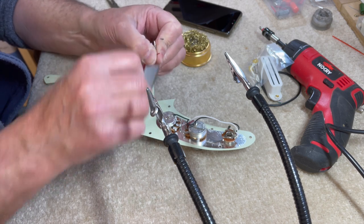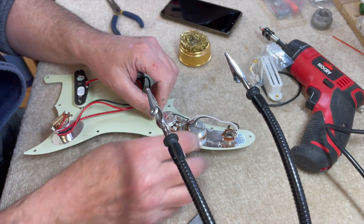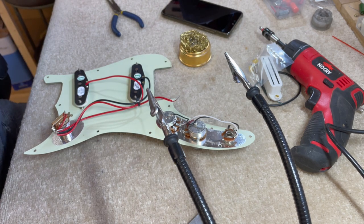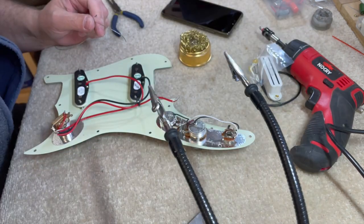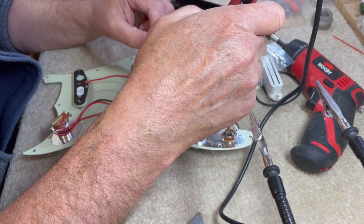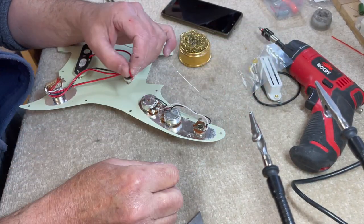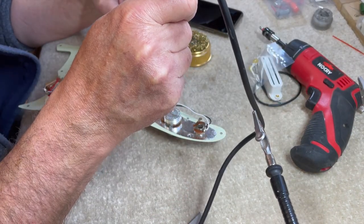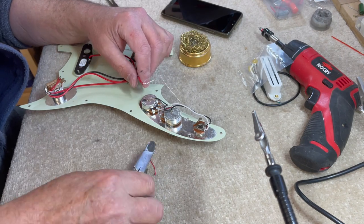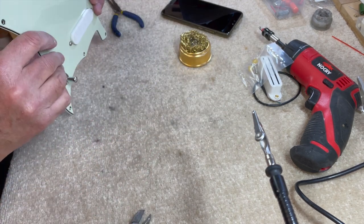and we have to switch them around, but it'll be a fairly straightforward business. The thing I have to be careful to do is, although we're not using any switching and it's just going to be a straightforward humbucker use in this case, we have to keep the bare wire separate from the black one, because that needs to remain grounded even if we switch the other one round and interchange the hot and the earth, because of the phase issue. I've been caught out like that in the past where I didn't realise that was a necessity. But once you know that, you don't get caught out. It gets a little bit complicated when you've got a whole load of complex switching going on, because the bare wire and the earth wire definitely have to be separate at that point.